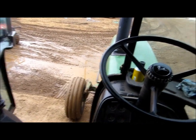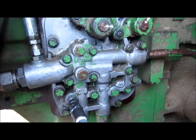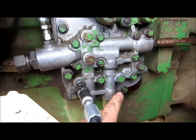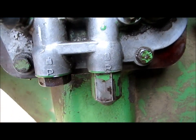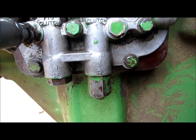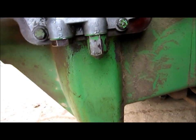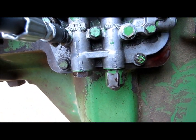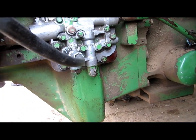At rated PTO speed we're at 145 PSI. Cranking it all the way up to wide open, it's making 150 PSI. On a tractor like this one that sees lots of hard PTO use, and again it's not a real hot day — the oil is warm but not scorching hot like when running equipment — it's a little bit on the high side, but I can live with it, so I'm going to go ahead and leave it alone.